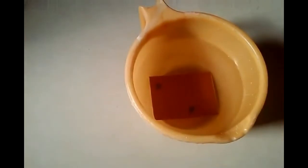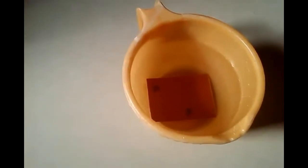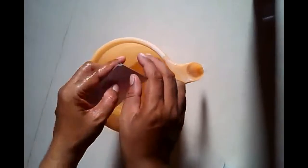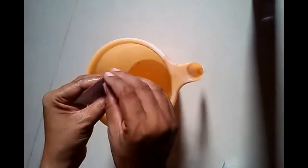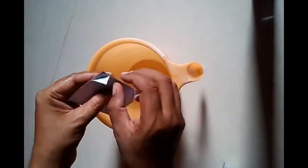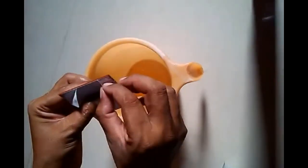We will put the plate in cold water for about 5 minutes so we will be able to remove the paper. After 5 minutes we will gently remove the sheet from the PCB and check that the impression of the print has come on the PCB properly.